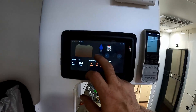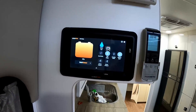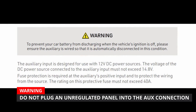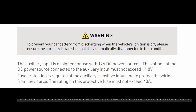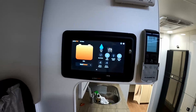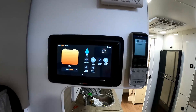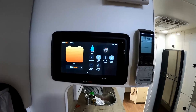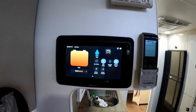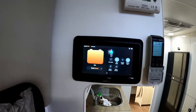I've checked it — it does work. Again, you would need to speak to BM Pro to find out whether or not it can actually handle the full voltage of your panels. I would be very cautious about plugging in an unregulated panel. Alternatively, you can buy 12-volt solar panels — those would be okay straight in unregulated, but certainly not the ones with a higher voltage, not without checking first. But a regulated panel, it works fine. Thumbs up — it's a good fix there. Cheers.